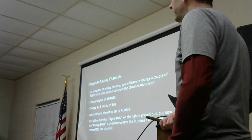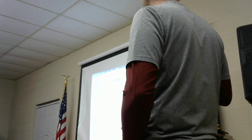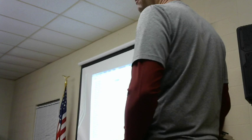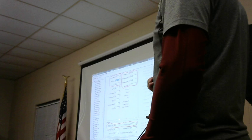One of the things you'll see here on the analog side, all the digital stuff's grayed out. So if you don't know whether you have a digital channel or not, that'd be a big cue, because you can't do anything with it. So you'll still address these issues here. You'll change that to analog. You'll change that to 25 kilohertz. And the rest of it's the same, except on analog, you always put always for your criteria. And then down at the bottom, this was grayed out before on the DMR channel. Now it's not. You can put in your PL tone on encode and decode.